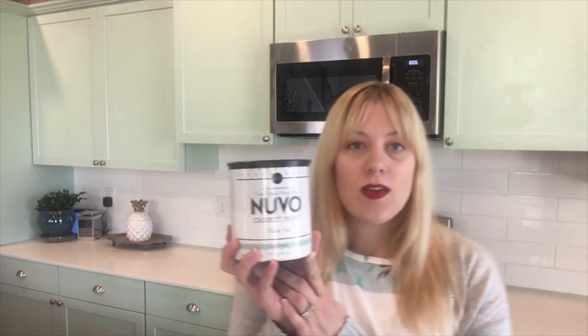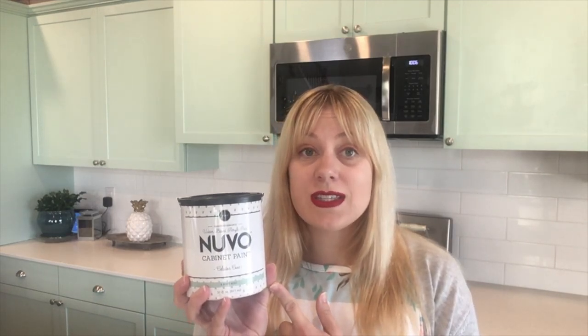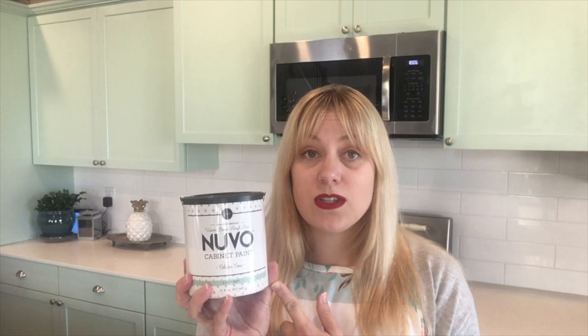I showed you in the beginning of the video it came in a box with two cans of paint, the rollers, the brushes, and the paint stick. I got these off of Amazon for $36 for the set of two cans of paint and it only took me two to do my entire kitchen. I have extra left so I can do a bathroom or something else with the leftovers. I found the paint to be very liquidy but surprisingly it covered very well. I would recommend Nuvo cabinet refinishing systems for ease of use and coverage of paint.